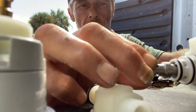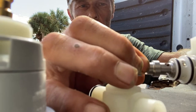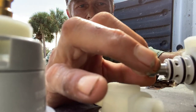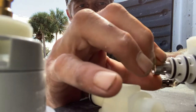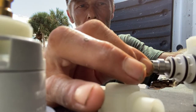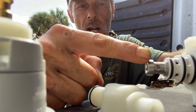when you're mixing the hot and the cold, this little cylindrical bearing will spin and catch in different slots in here to balance that hot and cold out. So it's moving back and forth inside, back and forth and around like that — and that's what the balance is. If I'm not getting pressure in from the hot, that thing is going to stick in one spot, just like that.